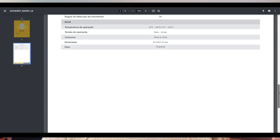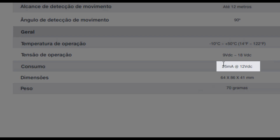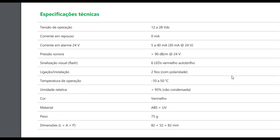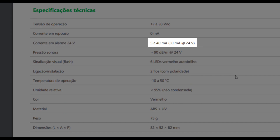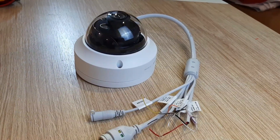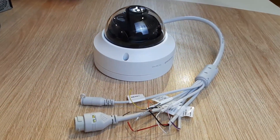To size the power supply, let's check the siren and motion sensor power specs. In this project, the camera will be powered via POE. It's important to check the camera's output relay spec to ensure it will be able to handle the power when activating the siren.